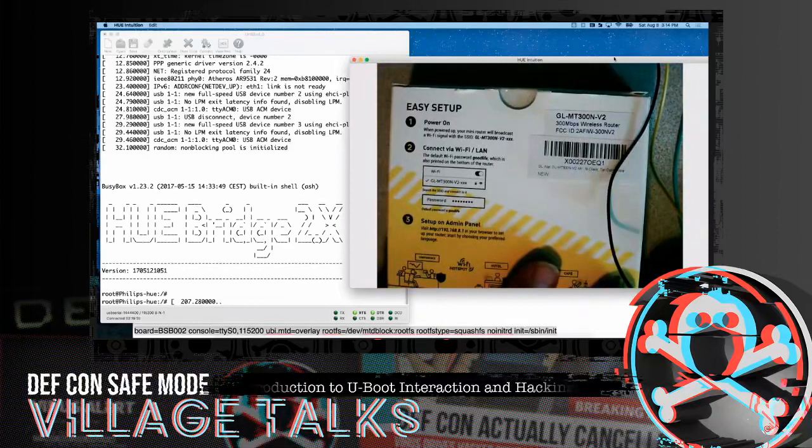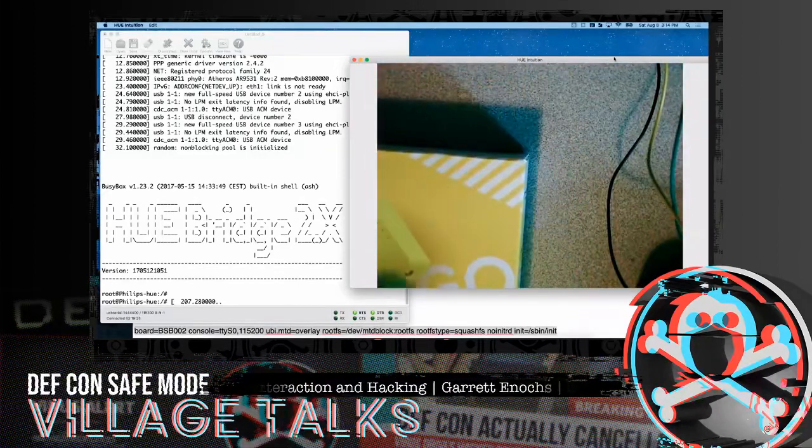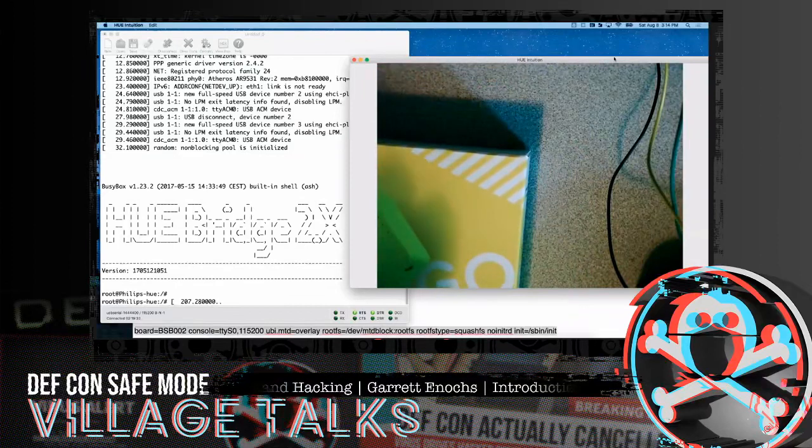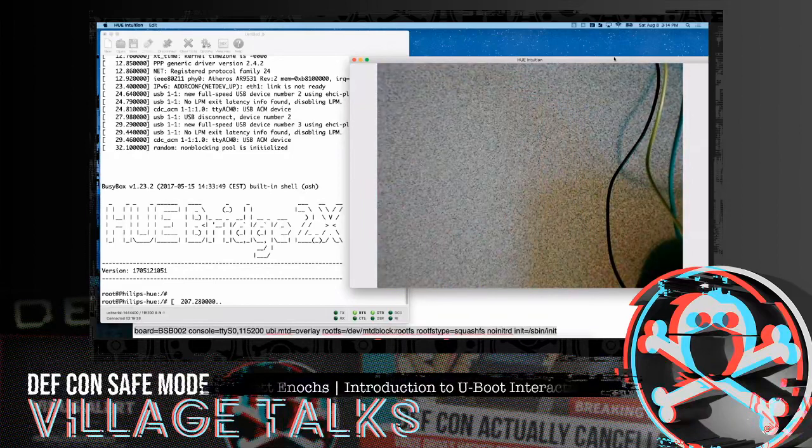A lot of these cheap devices are out there, and it gives you a chance to experiment with UART and JTAG and SPI chips and sometimes NAND chips and flash chips. The list goes on and on, and they're often cheap. Like I said, the Luma I like a lot because it has all of those same features, and you can get them for 20, 30 bucks used. It has USB, Ethernet, UART connectivity, NAND flash chips, and SOIC8 SPI flash memory chips on the device. So it's a perfect platform for hacking, attacking, experimenting. The pin glitch works on it also, as an example.